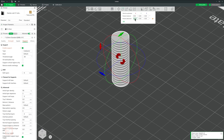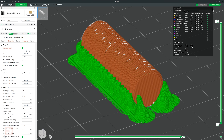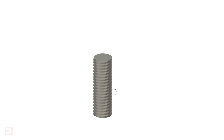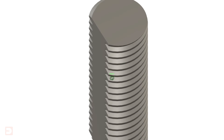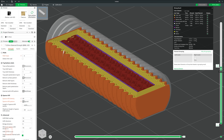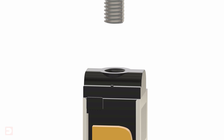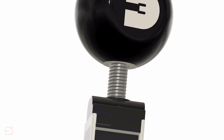The only alternative to printing these screws upright on their ends would mean printing along their sides using tons of support material, which would almost certainly impact the effectiveness of the screw's threads. But then I realized that's not the only alternative. If I designed the screws as separate standalone parts, connected to the cane post-printing, and then sheared off an area of one side, I could print them lying flat on the print bed without the need for supports or overhangs. With them printed sideways, the extrusion runs lengthwise, providing significantly more strength and preventing snapping due to delamination. These screws will only ever be placed under lateral force, unlike the rest of the cane under downward force, so this should be perfect.